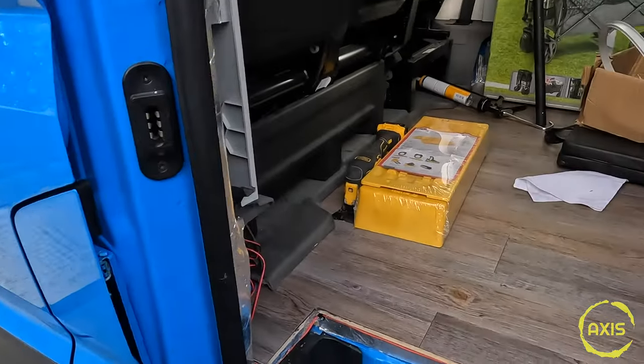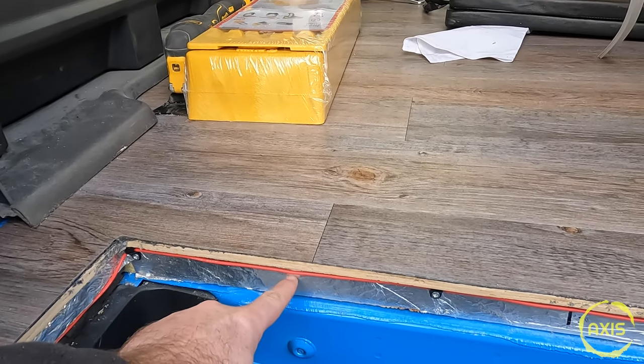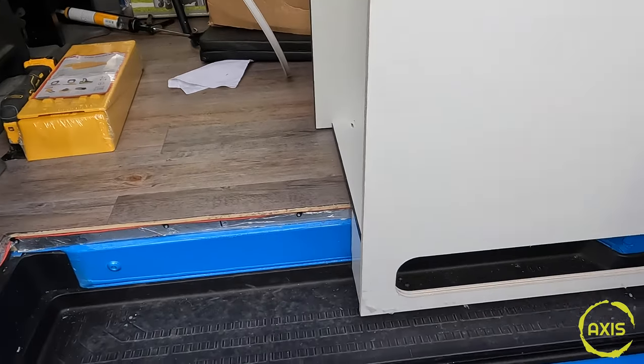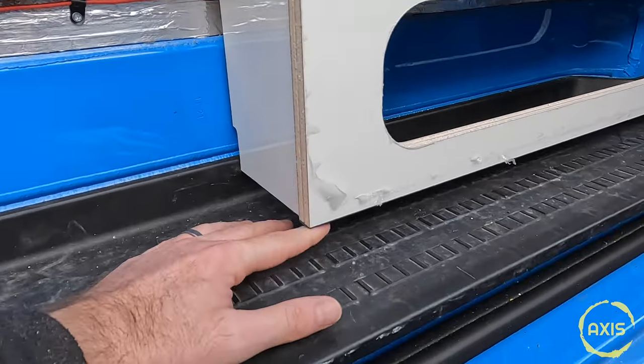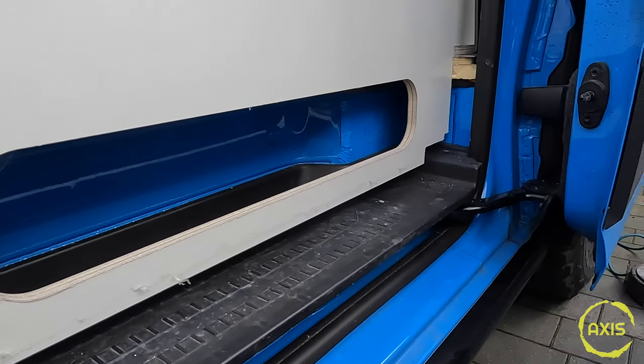I cocked up with this unit because my floor is slightly higher with insulation. The EVO unit is set to like 18mm and you can get a plus 30. I'm 25mm taller, so my unit's 25mm taller. So the drop-down bit, the step here, is much more than 25mm to be honest - it's quite big. So it doesn't match.